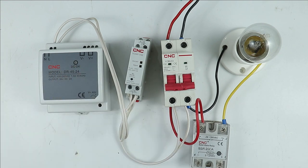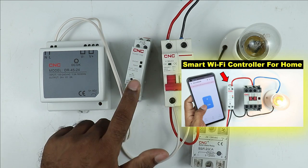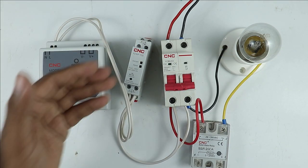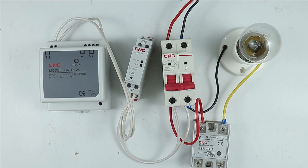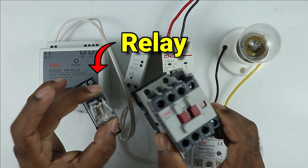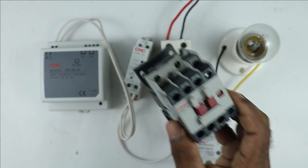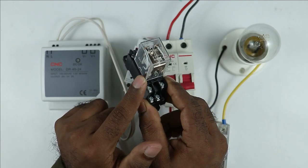Now we have DC power supply and we only have to perform connections to turn on the SSR by DC power supply. As seen in my previous video on the Wi-Fi controller, the Wi-Fi controller directly provides AC power supply — there is no NO contact, it directly uses the phase supply. So the problem here is that this Wi-Fi controller, which provides AC power supply, cannot be used directly to turn on this relay. In between we have to use a device — you can use a contactor or a relay. I am not going to use a big contactor; instead I am going to use a relay so I can easily control the control supply.